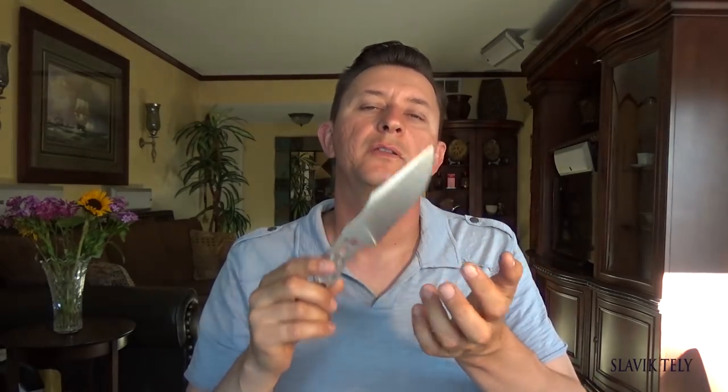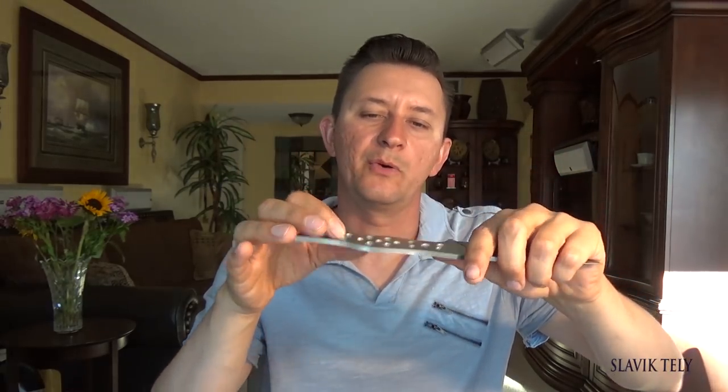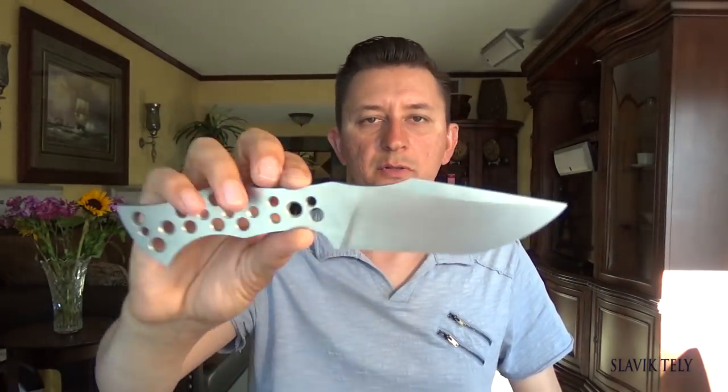If you want to watch a good video on hand sanding, Nick Wheeler has a 'Sanding 101' video that shows proper steps. I hand sand at 220, 320, 400, 600 grit — everywhere except the handle area, because I'll use the belt grinder to shape the handle later and I'd mess up the finish. On the handle part I'll only go to 220, leaving it as rough as possible so the glue sticks. For the blade I'll go to 600 grit, then ship it out for heat treat.